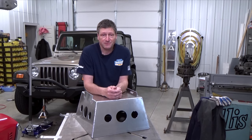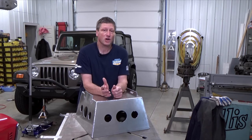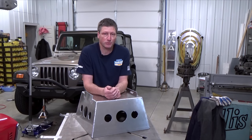You can get five 19-by-48-inch wide pieces out of a 4-by-8 sheet of 1/8-inch 5052 aluminum, which is good enough for four stands. I'm also going to use four pieces of 36-inch long 1x1-inch 6061 aluminum square tubing.